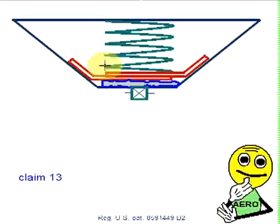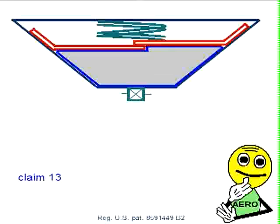So what happens is, as we load the spring, or gas cylinder as it may be, as we load the hydraulic fluid into the flexible plastic bag, it pushes up on the partition, and the walls of the partition start sliding. They are slidably interlocked, and they slide apart along the walls and that increases the surface area that we're using to apply force to the elastic material.